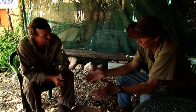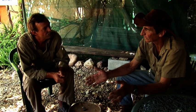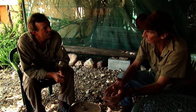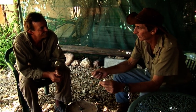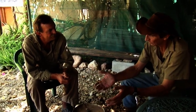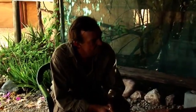From there, we actually still wash by hand in just a big sieve. Not as fast as a machine, nowhere near as fast, but it's actually more efficient because we don't miss anything in that. All the heavy stuff drops to a pocket in the bottom of the big sieve, and we just do that by hand. Still do it very quickly. It's just a little bit of a process, that's all. And again, physically it's probably a little bit more demanding, but when you hit a bad patch, you're not wasting fuel, so your costs are way down.